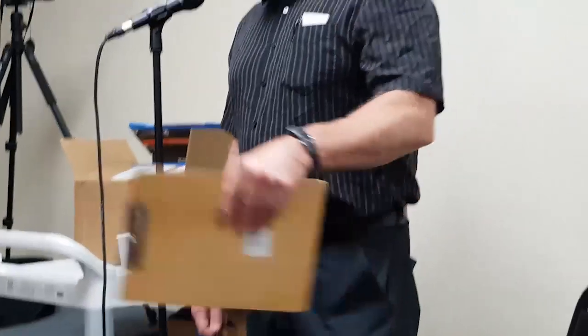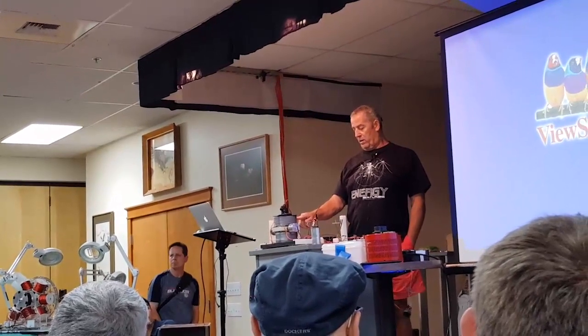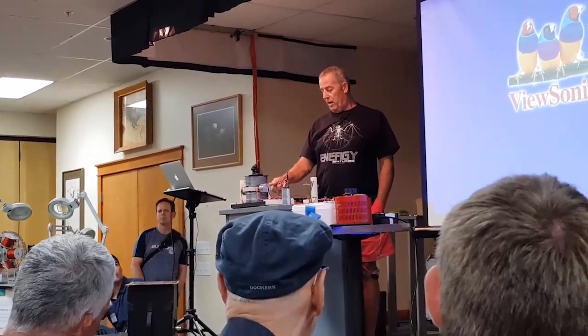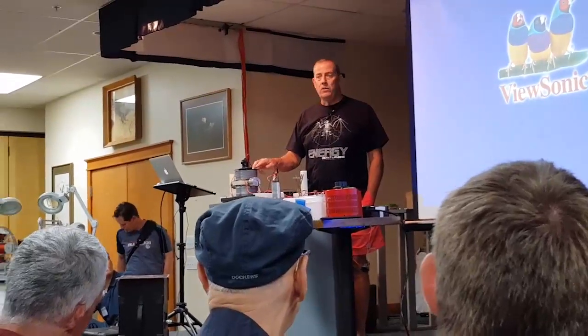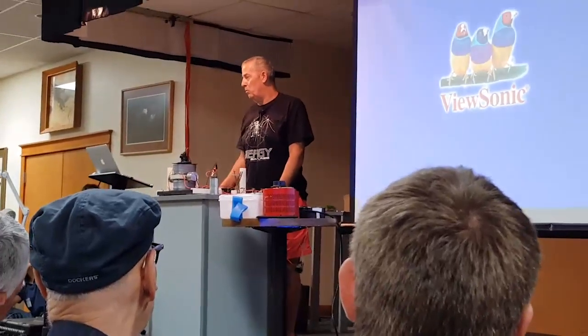Now, what were you saying the windings on that were? I didn't catch that, you said it so fast. Oh, the windings are 2,000 turns. 1900 turns, 2000 feet, number 25, and 68 ohms. Now remember, the other thing that I saved to the very end: it doesn't really matter about the wire except for poundage. Look at this thing as poundage. When you have a lot of poundage of the wire, it will work. Once you have enough poundage up to a certain point, you'll have it working.